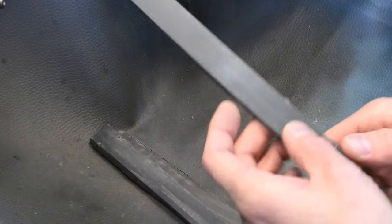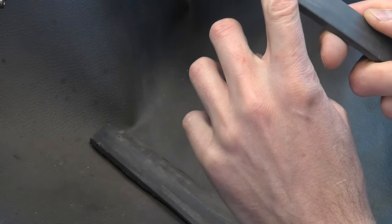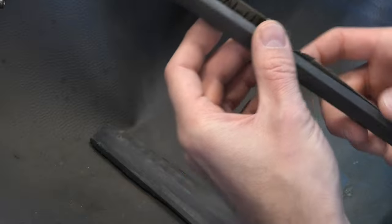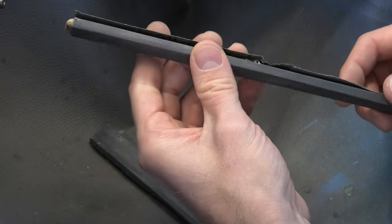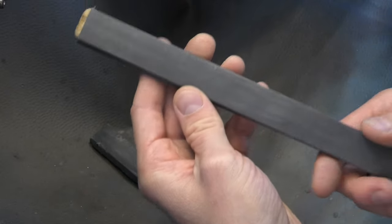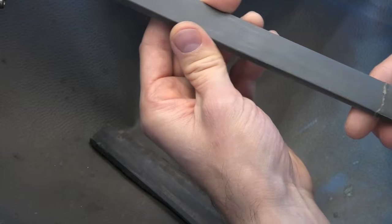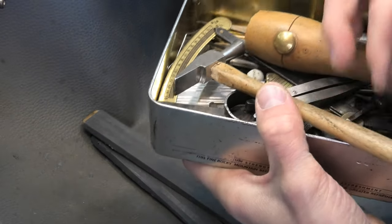600 is good — a little bit grittier. Basically the lower the number the more grit you've got. I call them buff sticks; some people call them emery sticks because the paper is emery paper, also referred to as wet and dry. You can wet this paper to take a little more coarseness out of it. Emery is actually a country or island near Greece — that's basically where the stone was discovered. It's a corundum stone, ground up and glued to a strong, waxy paper.